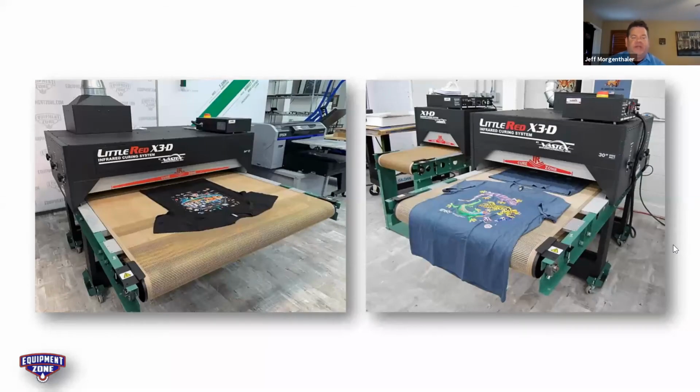On the high end, the 10, of all the categories that you should be at a 10, it should be in the curing process. You should have a professional heat press and/or a conveyor dryer. With the professional heat press, you're going to have consistency. You're going to have a heat press that's going to last. The heating elements on the Geo Knight have a lifetime warranty, so it's going to last.